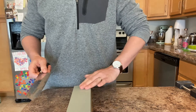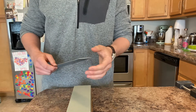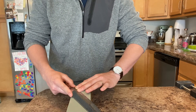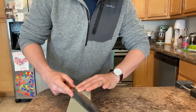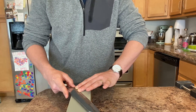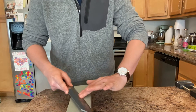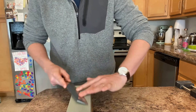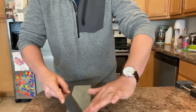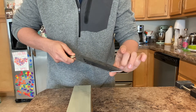I'm still going to finish on the nano hone. The 800 grit stone leaves a really nice finish since 800 isn't that coarse, but it is soft and aggressive so it can be a little tricky to deburr on. That's why I like the 1000 grit stone — easier to deburr and gives a little extra polish while still being quite grabby. I find I get a little over-polished when I go to the 5k. I like 1k finishes on my VG-10 and SG2. So the knife is currently at about 11 or 12 degrees and I'm going to go up to maybe 14 to 15, which looks about right.